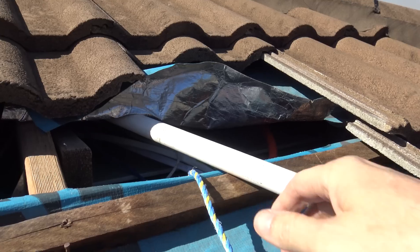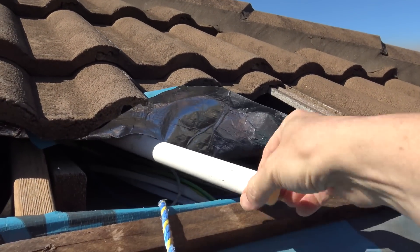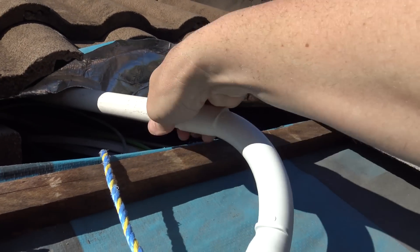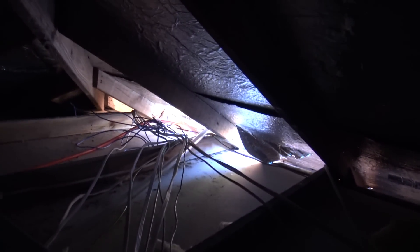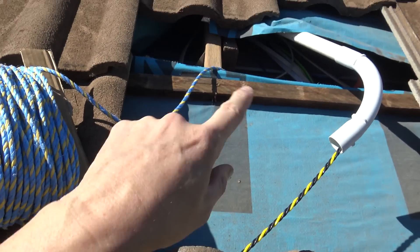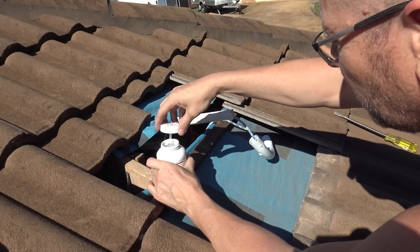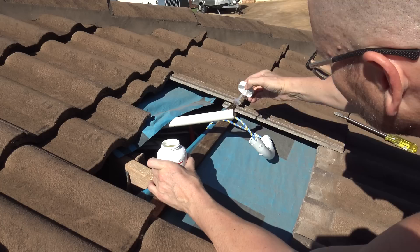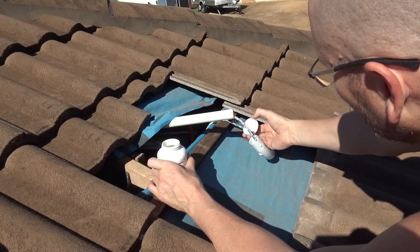So here's the top end ready to go. At the top I've got that rope and I've just stuck some of the conduit through there - it's going to have one of these angles going down. In the roof I've got the conduit and it heads off to that outdoor bit where I was before, past all the existing electrical cables because the switchboard's over there. So that'll go off to the garage. I'll put a bit of this glue cement stuff around this side, not the other, so that when I put the cover on it won't slide into the bend.